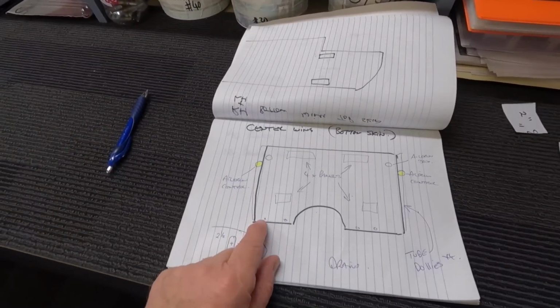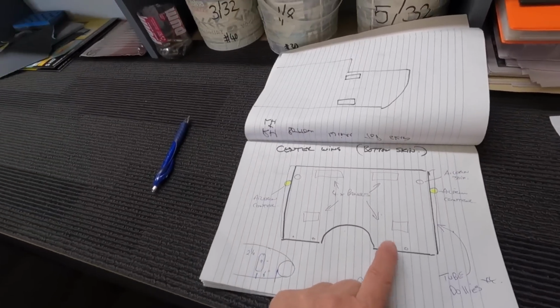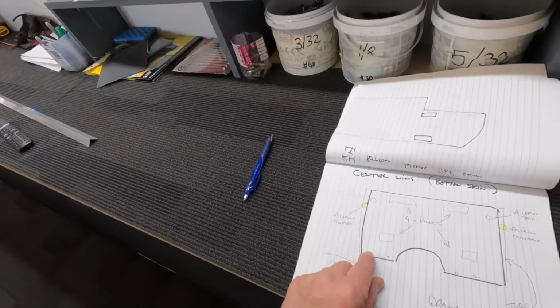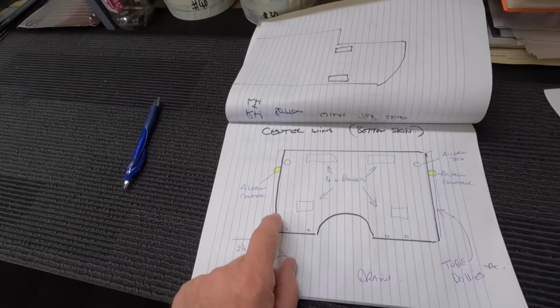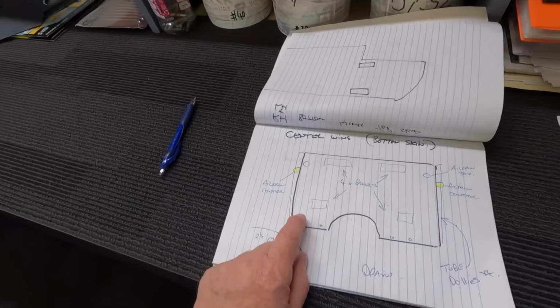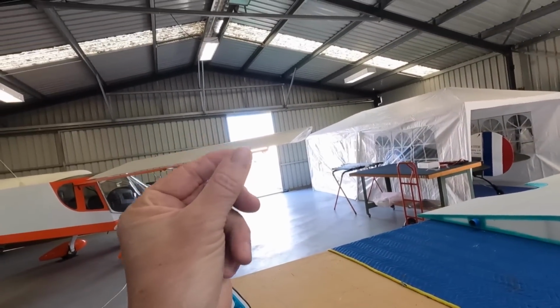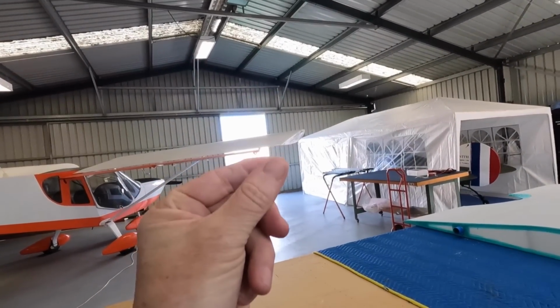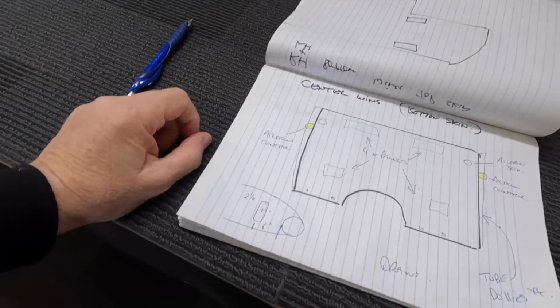I forgot to write down I need a drain hole in every bay. I noticed some aircraft are in that book. They just glue the washer on, no doily. But I think I'll do the doily, it'll stay on. When a Tiger Moth taxied in the other day, I noticed it had seaplane drain holes, and a couple of them were broken off, just gone because they didn't have doilies on.